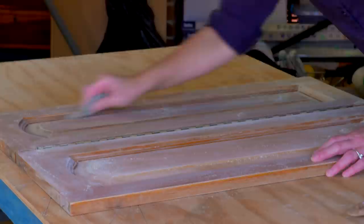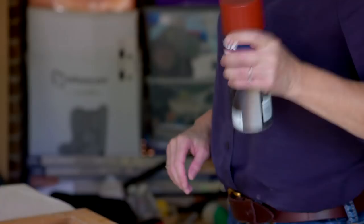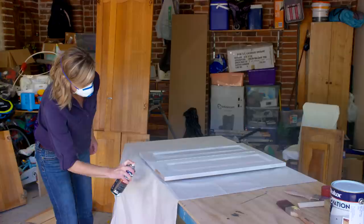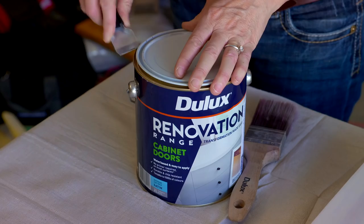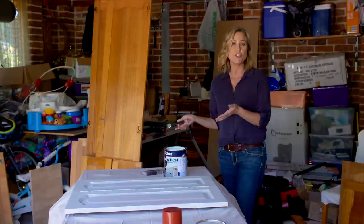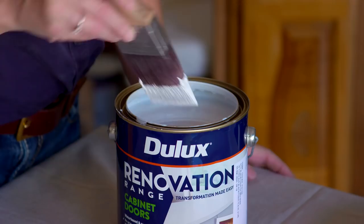With this particular paint you don't always need a primer, but because I'm working on raw timber I don't want any staining to come through my top coat color, which is white. So as an insurance policy I've gone in with a stain blocker sealer — you can buy this in spray or brush-on form. This really is an achievable job. You could do your cupboard doors one weekend, your bench tops another weekend, and the best part is you can keep using your kitchen in the meantime. On with the paint — satin white, can't go wrong.